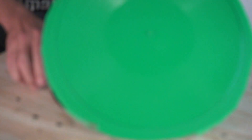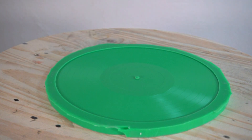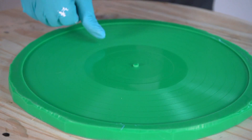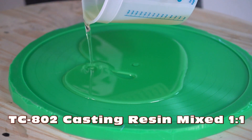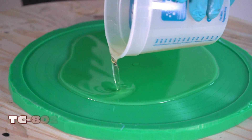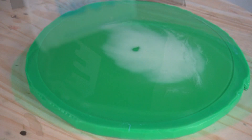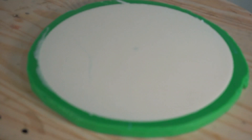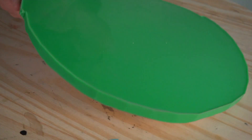Here's our finished mold four hours later. You can see when it hits the light just right, those little grooves are all captured. It just remains to be seen whether we have enough detail to reproduce the sound of the original record. Now I'm pouring in a very small batch of TC802 casting resin. I used TC802 because it was the lowest viscosity resin I had in my shop, so it can easily fill in those grooves and details without having to pressure cast the part. I might do a more involved test with a slower setting resin in the future, but the TC802 was great — I was impatient and wanted to see if this worked.